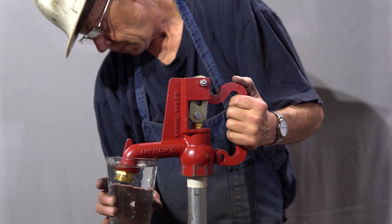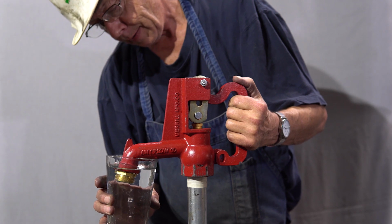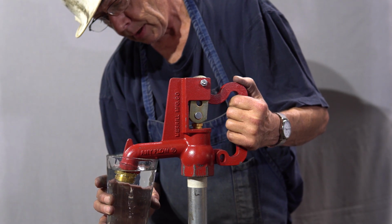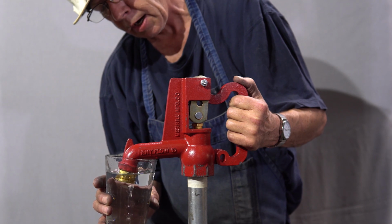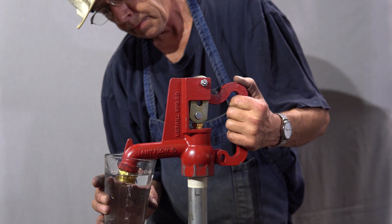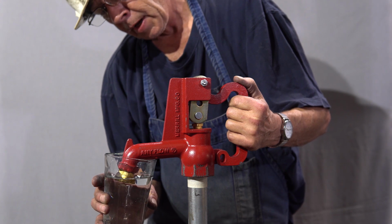If working correctly, the water level should decrease as suction from the draining water empties the container down the pipe and out the drain hole. If the water level does not decrease, follow the procedure in our leaking out of the nozzle video for the C-1000. This will lower the rod and plunger, and the hydrant should drain properly.